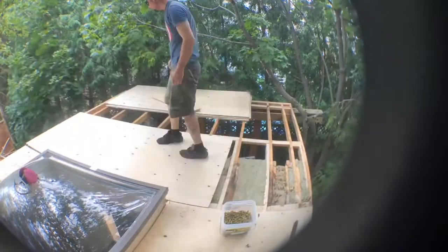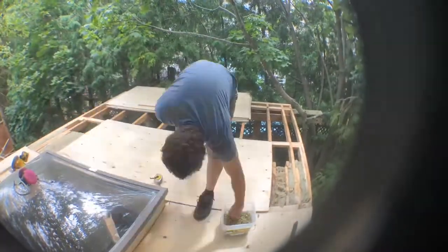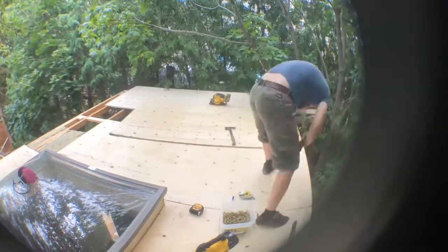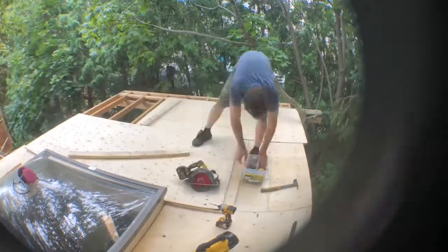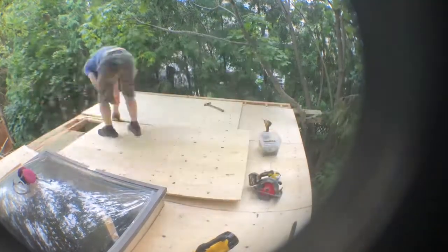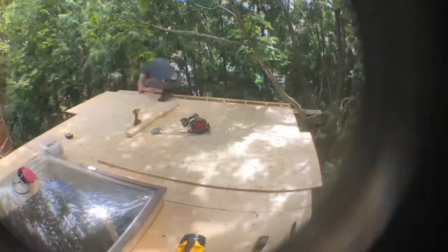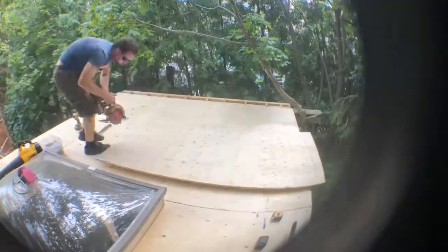The entire plywood project portion of this probably took about four hours. Part of that is that when you have a piece of plywood, positioning it is everything - you want to maximize the length so wherever it sits it doesn't need to be cut. In some cases I needed an extra two-by-four, so I had to slap it in there just so I had a bit more meat for the sheet to bite into. That kind of happens sometimes - you just go with it and get it all done.